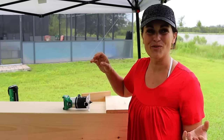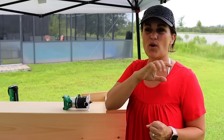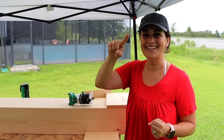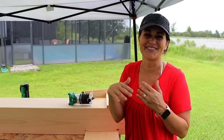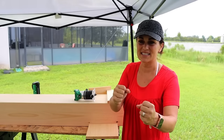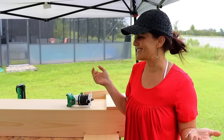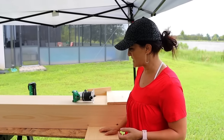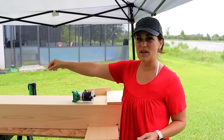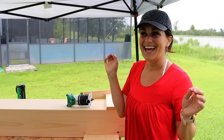I'm not a routing pro but I have done it before. Since we're doing a straight cut, generally speaking on the outside you go counterclockwise and on the inside you go clockwise. When you do this you need to feel like you're pushing it against some pressure — if it's going smoothly you're probably not going in the right direction. So we're going to clamp this down, put a decorative edge on it, then miter it and wrap the base. I've also got some decorative pencil molding to add to the front face, then it's priming, painting, and completion.